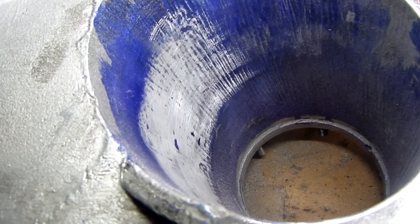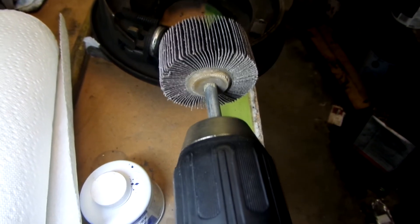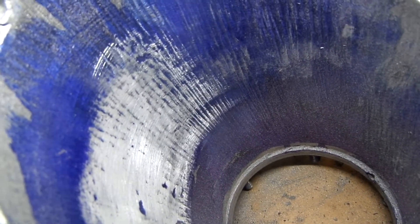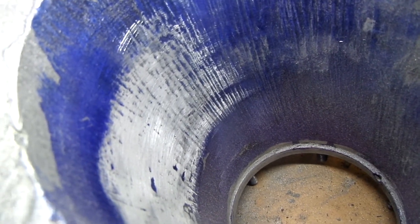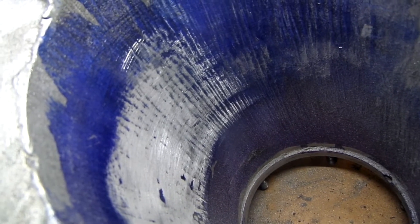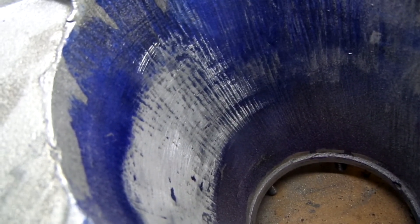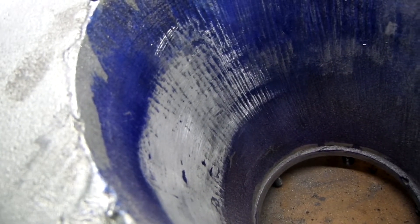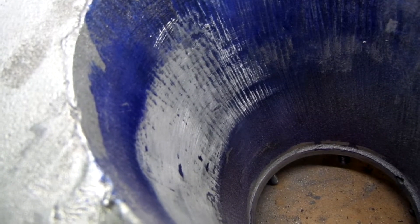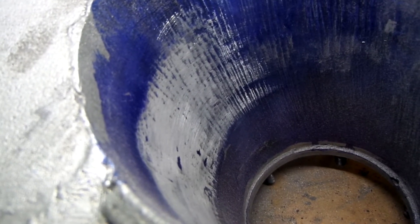What I'm doing here is I have just one of these little flap wheels on my drill, and I'm using that to sand off the material in here. You can see there are horizontal striations in the casting — I don't think it's from the casting, it must be some kind of crude machining they did just to get things to fit with the universal joints. What I'm going to do first is sand this down in the area where I had interference until all the striations are gone, then paint it with the Dykem material again and try the assembly to see how I did. This is probably going to be the most tedious part of the whole installation.